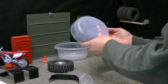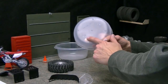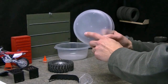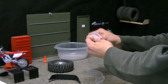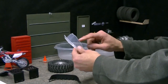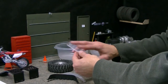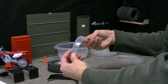And you're using the same piece of plastic the whole time. Now if you look on the bottom of the piece of plastic, these ones all have this little recycle code on them here. Almost all these plastic containers have a recycle code. This one is a number 5. A number 5 is polypropylene. It's a really flexible material. You can get lots of use and wear out of it. It does crack if you have a jagged edge. So what I recommend is after you're done cutting it off, sand the edges smooth.